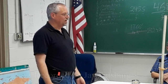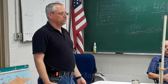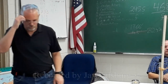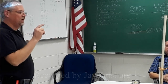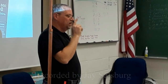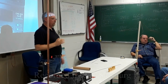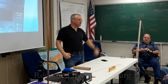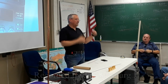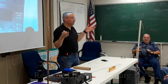Yeah. And to respond to Bob's comment, if you're off a little bit, it changes the feed impedance and everything goes screwy. These things are awfully sensitive to feed line changes. A broadband antenna isn't quite that sensitive to feed line length differences. Let's take your cable and stretch it with another cable. If my theory is right, this is close to 9 quarter wavelengths, that would be that magic, mess you up type of length of cable, right?